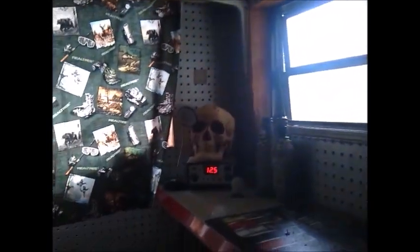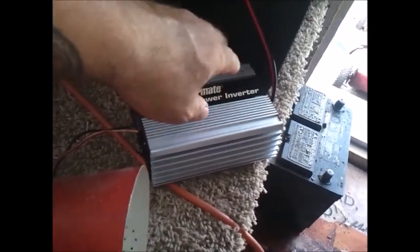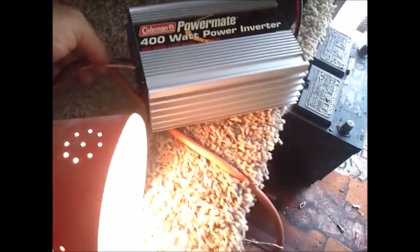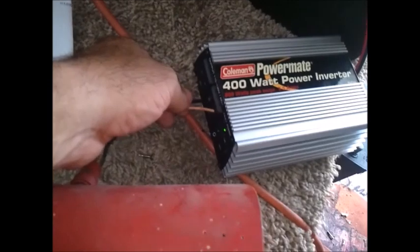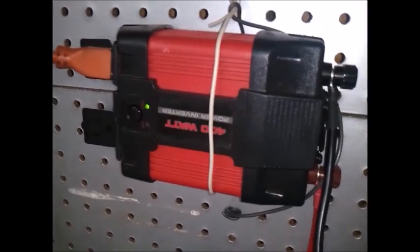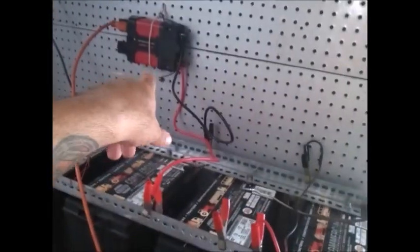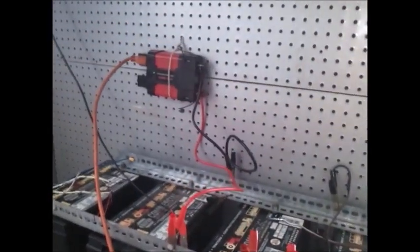With the sun shining a little more, still at 12.5 - can't beat that. A little note I'm throwing in here: I've hooked the little 400 watt Coleman power inverter back up. I just have the wires going right into it normally, running a little light - it's fine, just got a green light. But when I tried hooking up the fridge to this Coleman, it told me fault. It's 400 watts, 800 watts peak - it's crazy that a brand name like Coleman cannot run that fridge, but Harbor Freight can. That's normally the other way around when it comes to power solutions.